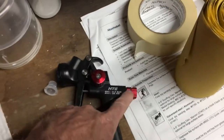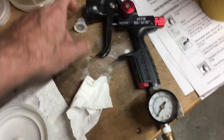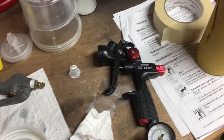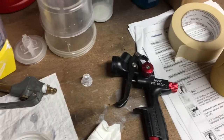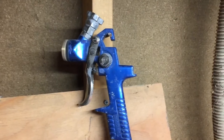I didn't think the air adjust worked quite right. I'd get back pressure on just a small movement there, which was making it act all funny, but I got it where I could run the pressure that I wanted — I think I was running about 25 or 30 PSI. So it worked out okay. I kind of went against my own rule about buying cheap tools. I had a DeVilbiss gun that I used 10 years ago and don't know what I did with it. The gun I had been using and was having trouble with, I still used that for primer yesterday and it's working good — I think it was just also suffering from too low pressure.